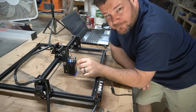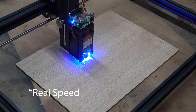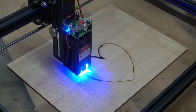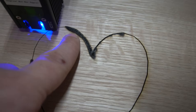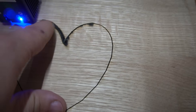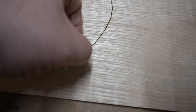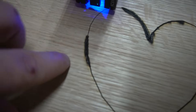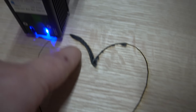I'm going to slow it way down and go full power and see the results. This right here is 100% power, 10% speed. I learned you can actually speed it up as you go, so I sped it up to 80% here because this is making a lot of smoke. It's tough to tell, but I can get my fingernail in there — that's about a sixteenth of an inch in depth. Slowing it back down burns a little deeper, but obviously that's undesirable and just makes a mess.